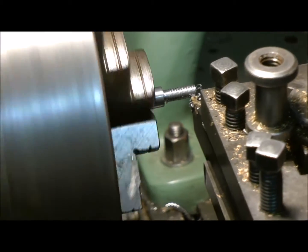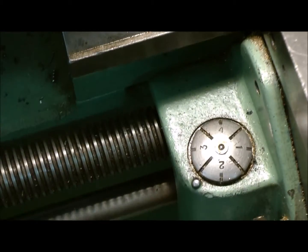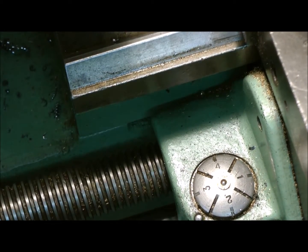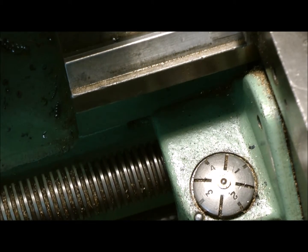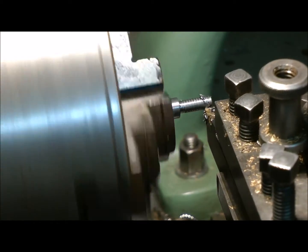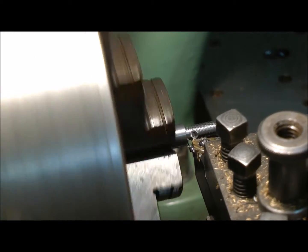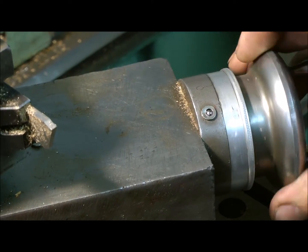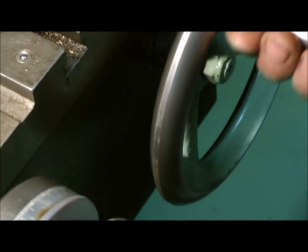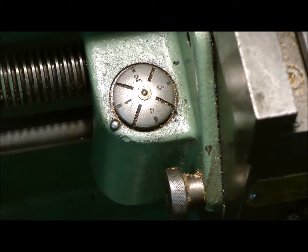So let's pack it out. And forward. Advance — I'm advancing ten-thousandths at a time. Just wait for number three to come along. Engage at three. Back up to the action. Nice engage. Back that off. Wind that back. Add ten-thousandths to that — add ten-thousandths, add ten-thousandths, add ten-thousandths. Back onto that. Should be number one again.